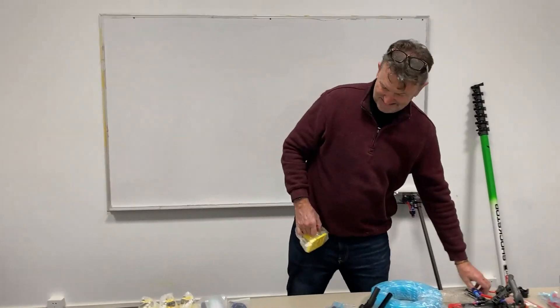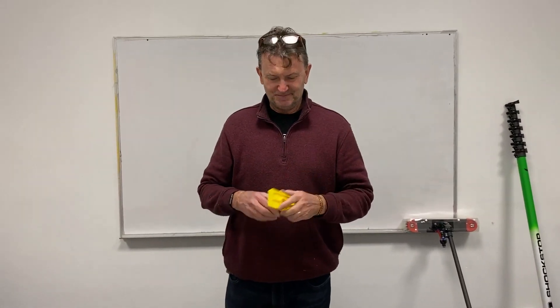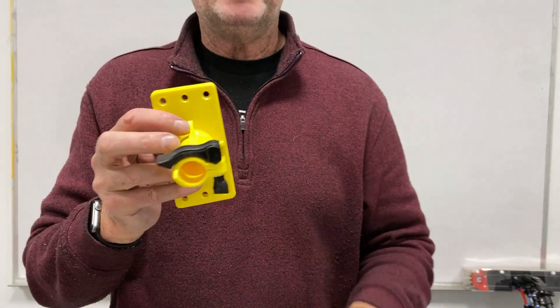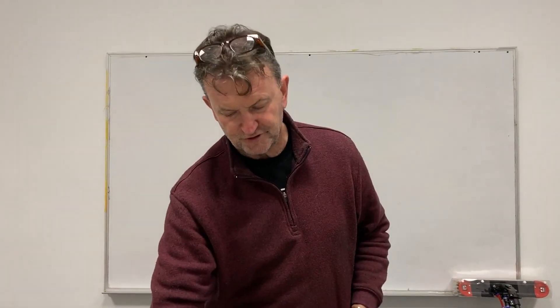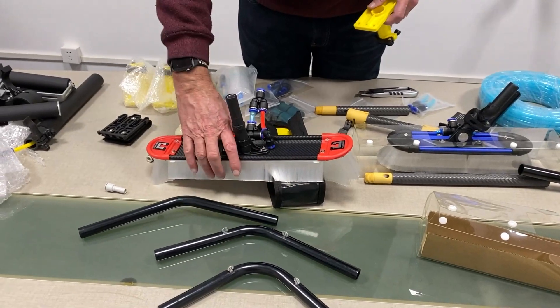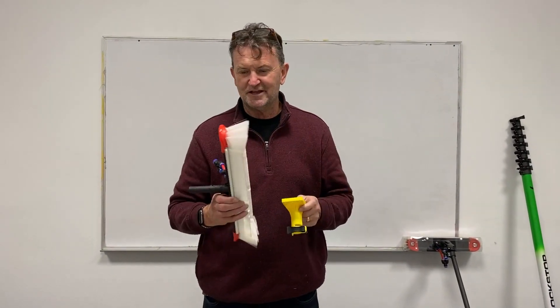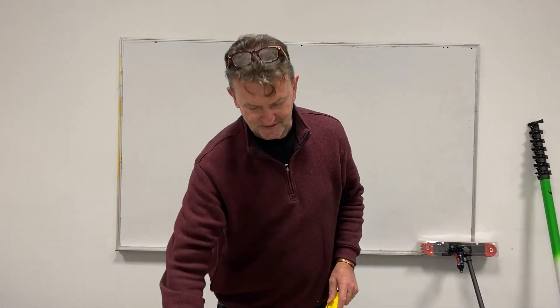The rule of efficiency is: a place for everything and everything in its place. So we give you keeper. You screw keeper into a panel — just make a panel for storage of your brushes. Because we give you five brushes, you don't want to throw them in the back of the pickup or in a bucket. The problem with nylon is that nylon actually absorbs water — when it absorbs water it has a memory, then you put it down and all these bristles are like this, those bristles dry, and when you pick it up it has the same bent shape.